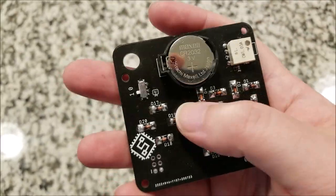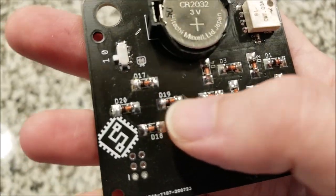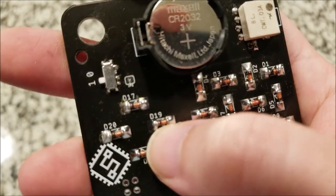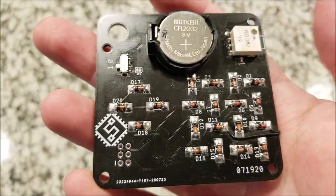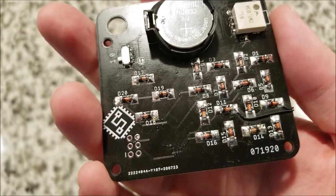Everything else was fine. I erred on the side of caution for the diodes, so the pads are massive for them. These are MELF packages. The best thing is this will be compatible with many different package size diodes.